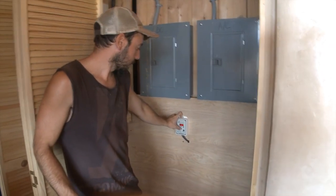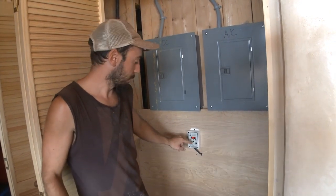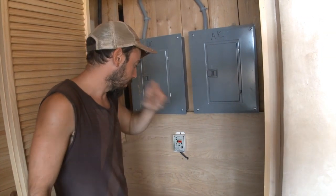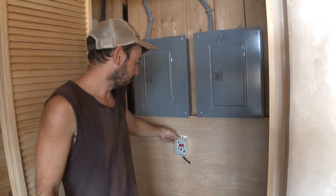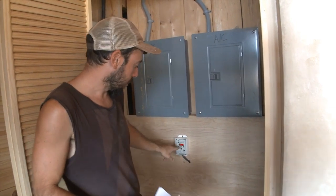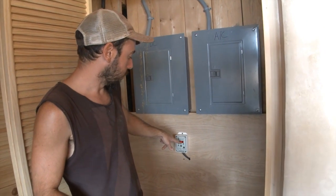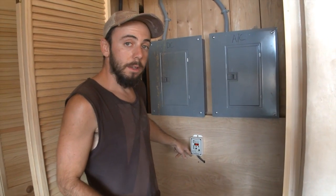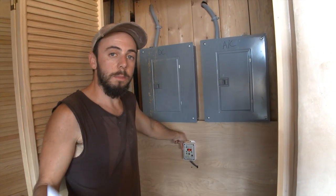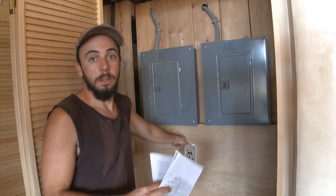The other things it shows: it shows you volts of the system — currently I'm charging at 26.7. It also shows what I have set to watts, though it can also show amps. This number with a blinking dot — 1.02 — means 1.02 kilowatts coming in through the array. That number is actually the amount of electricity being generated by the solar panels minus the amount of electricity being used in the house.